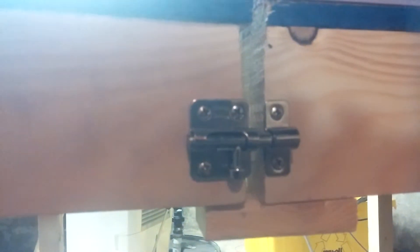I made a cut through here all the way around. I braced it in on each side — you can see the line there — right up here where the gate swings through. I put a simple bolt latch right there, and I have a cleat underneath here and a cleat underneath in the back. That way it rests on them. When the gate is closed, the weight is not on the hinges; it's on the entire frame assembly, so if this side shifts, it takes that side with it.